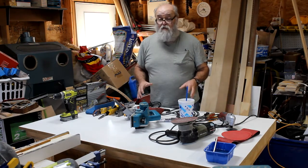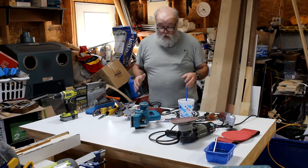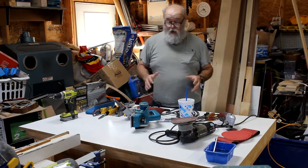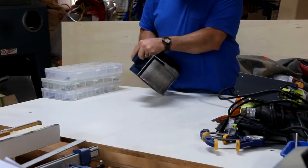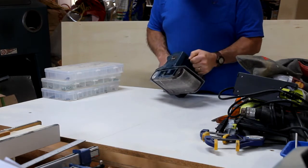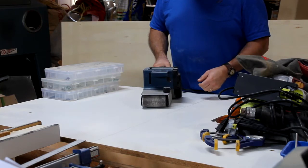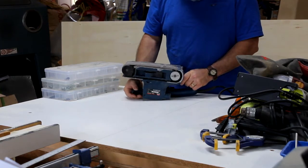I hope this is informative because if you're going to build a boat like this, these are all tools that, while you can get away without them, are very cool to have and will save you a whole lot of time and make life a whole lot easier. I have this old Ryobi belt sander that I haven't even used in years. A belt sander can be very aggressive — it's kind of crude and bulky, not a very precise tool. It can take off a whole lot more material than you want to and cause problems in a hurry, so I very rarely have much use for it.